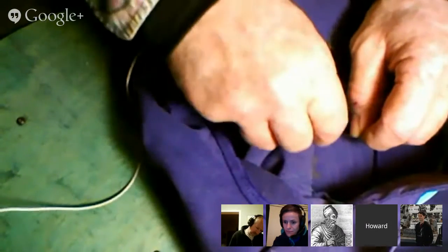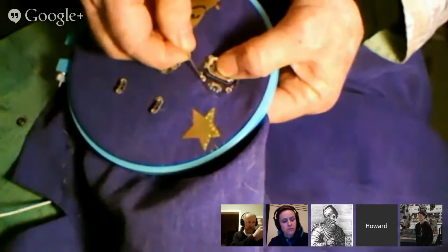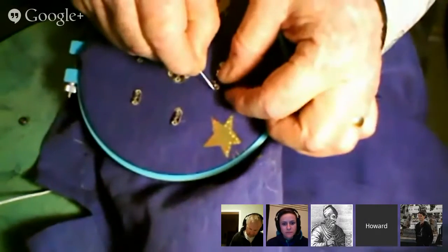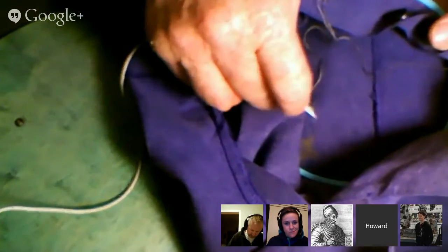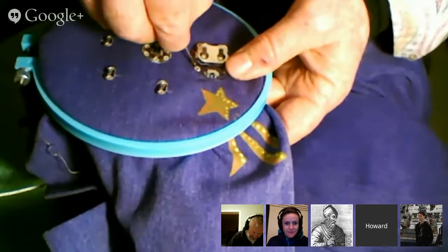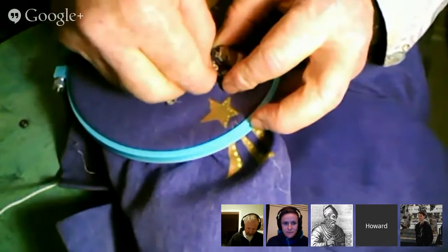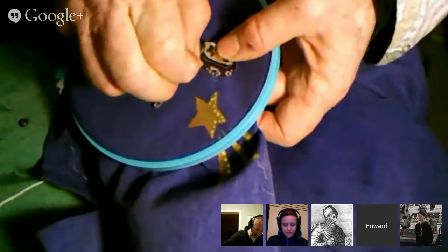So your instinct, what you said, is right. It is more powerful, but the problem is that if the voltage isn't high enough, it's not pushing with enough pressure. If you put two of them together, and if you notice, most circuits you see AA batteries in use two or four, you can add the voltages up. With two of them they're pushing twice as hard, and with four of them, four times as hard, and so they can cause the current to flow. What's a good analogy? It's like a hose. If you've got bad water pressure in your house, the hose won't shoot as far as if you've got good water pressure, even though the hose is the same diameter. The better pressure you have, the more water comes out. The same thing with electrons. So that's the long answer: you're right, it has more power in it, but it doesn't have the force to push that power through the LED.